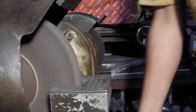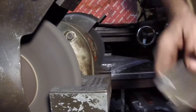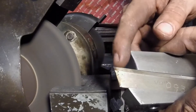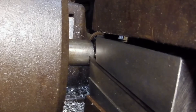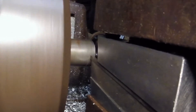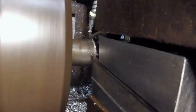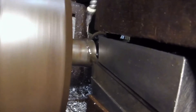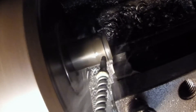Now we're going to sharpen up the tool bit — that's going to work pretty well. Just hone those burrs off with the stone. It's mounted up in the tool holder on the Bardon and Oliver number five, which is a turret lathe.